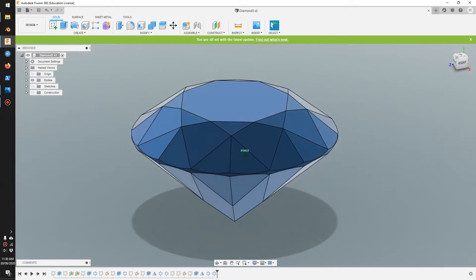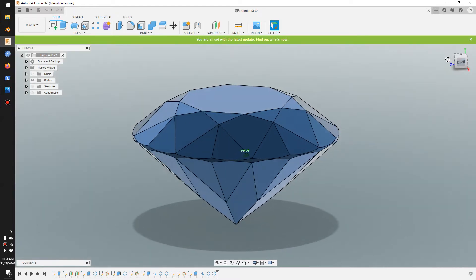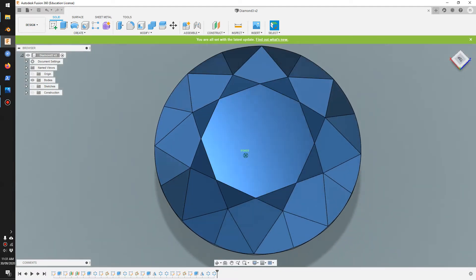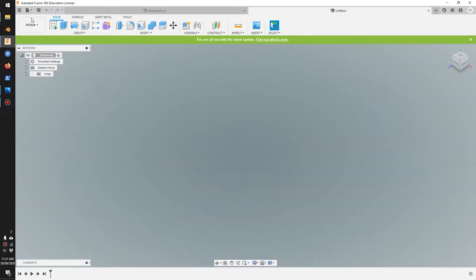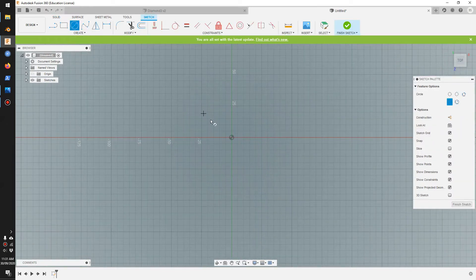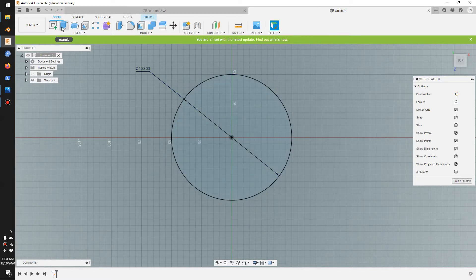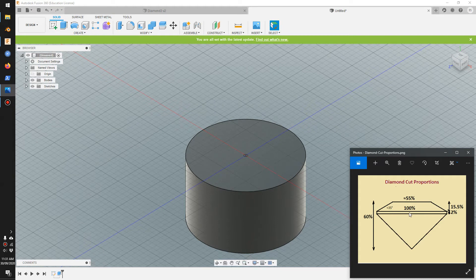Let's have a look at the model. We'll make the diamond from a solid cylinder shape, then we'll cut each of the faces to make the diamond as if it were ground from the actual material. Let's go ahead and create a new design. I'm going to turn on the layout grid and create a sketch on the top plane, then create a circle on the origin. My diamond is 100 and I'll go solid extrude down — I'll put minus 60.